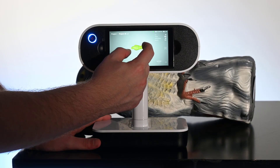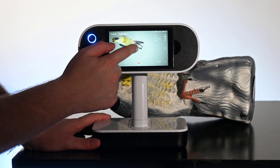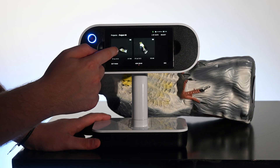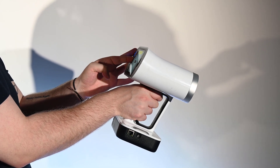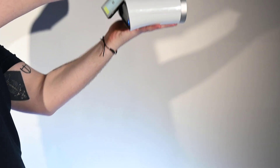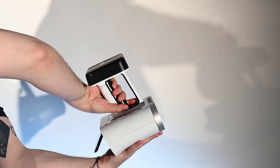Try to keep an even distance, about one foot away, from the object at all times. If your distance histogram begins appearing red, you may be too close, and blue means that you're too far away. When scanning a part, don't be afraid to rotate the scanner to different orientations as well to properly capture all possible angles of the part. The benefit of having a handheld scanner is the fact that we can reorientate the scanner itself using our wrist.